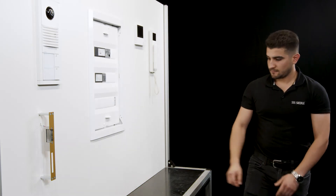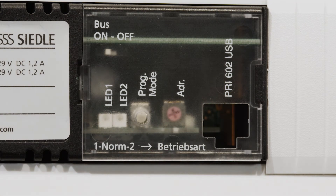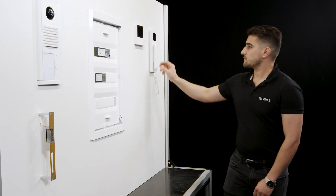To turn off plug and play mode on the network device, press the program mode button for about one second. LED1 will flash as normal. Carry out a functional test. Thank you.